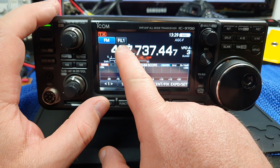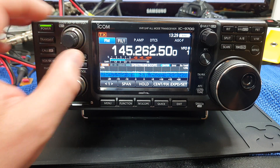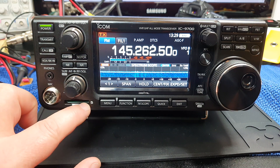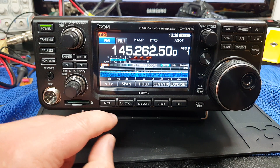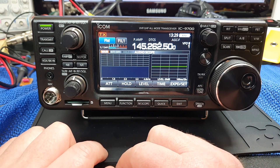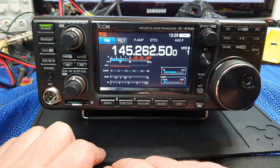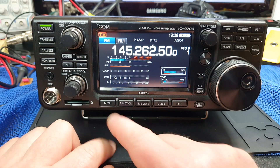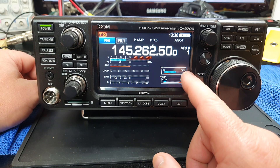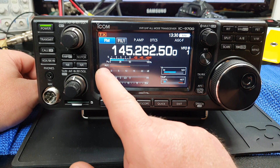Down this way we've also got an SD slot in the bottom here, which you can save memories to, recordings and that sort of stuff. Here you've got a menu button and your typical menu where you can switch between your scope and audio. I like this screen actually - it's quite handy. It gives you some idea of SWR and power consumed by the DC power cable, it gives you the voltage going in, and it tells you what temperature the radio is at. There's compression and ALC there as well.